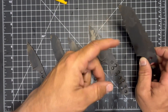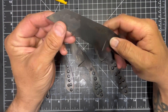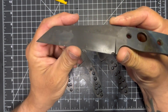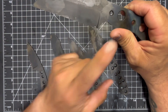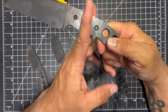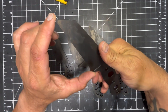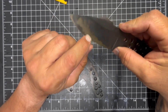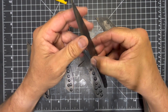First round of temper is done — this is the first time you guys have gotten a look at them. Every time I quench and then temper, you get all the forge scale and everything else off. I was able to get the crow done — the oil came up to about here on the handle, but as long as the blade area gets nice and heat treated we're good. You can see we're starting to get that nice brown color — that's the temper making that color. I need one more round of tempering.